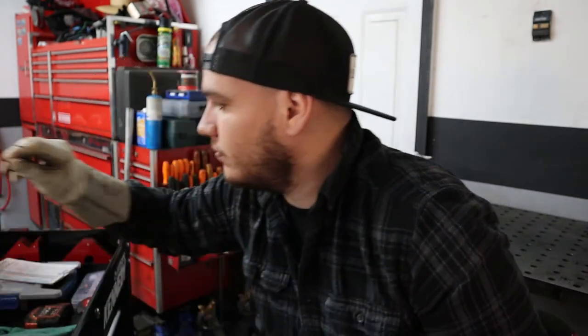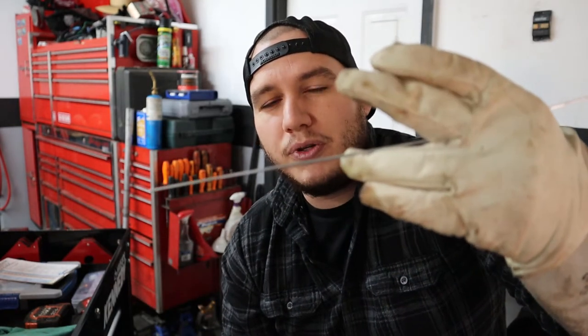When you are feeding filler wire, the way I feed is between my middle finger and ring finger — I push my fingers out and feed them back in. You can practice this in front of the TV. When you have thin gloves it's easier to feel the wire in your hand, which is extremely important when learning to hand-feed filler wire. Go get gloves that fit nice and tight so you can feel the wire, choke up on the torch, and not have anything impeding your movement. Long gauntlet-style gloves also give added protection when leaning on hot parts.